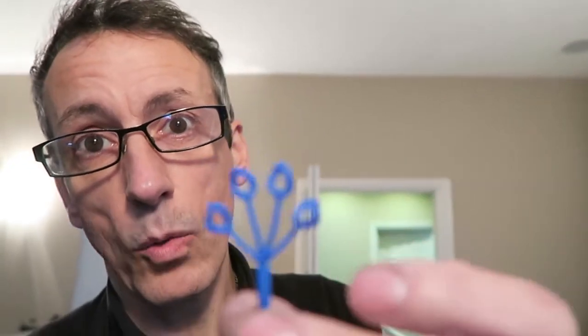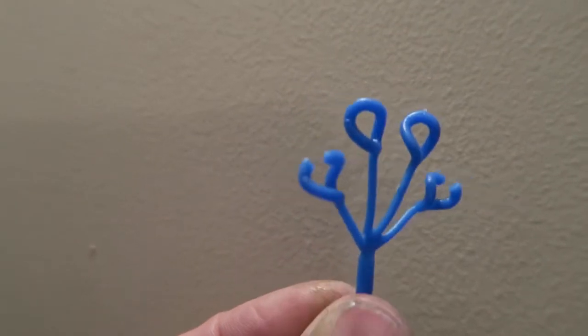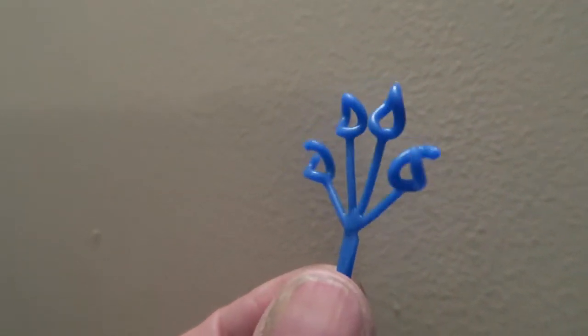I am making these little waxes. Each one of those is a curb link. You can see we've got 2 open links and 2 closed links, which means I have half the amount of soldering as what I would normally do if I was making this up by hand. I've got to make 60 links, 20 links for the necklace, 40 links for the bracelet. Clients provided me with all the gold, which is brilliant. So I've got to make up 15 of these little guys. I've done 2 so far.